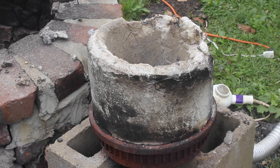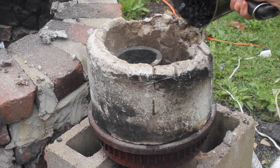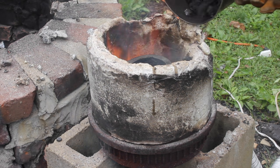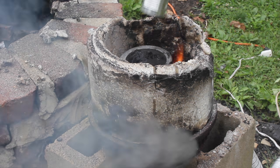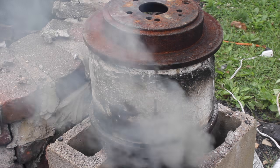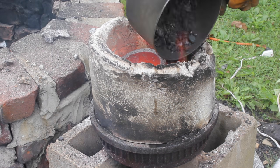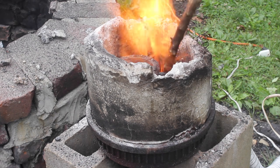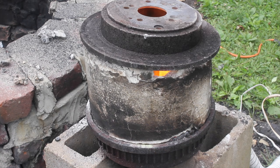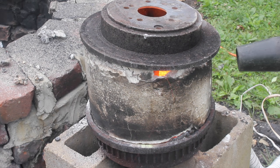I started another fire in my foundry, turned on the air, and let the crucible start preheating. Then I began packing the coke all around the crucible. When I saw the crucible start to turn red, I added the copper and put the lid on the foundry. As the coke burned away, I kept adding more to the fire. I found that I could improve the airflow in the foundry by using a stick to poke holes in the coke. To further increase the amount of air in the foundry, I used a leaf blower to inject air into a gap between the lid and the foundry, at an angle to make it swirl around the crucible.